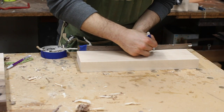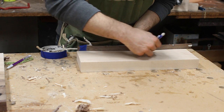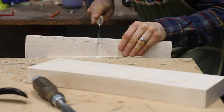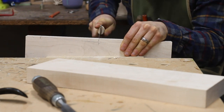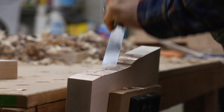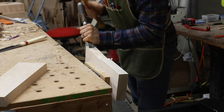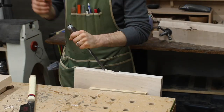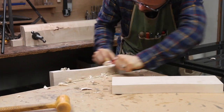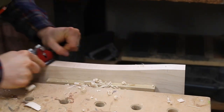Before attaching the legs to the workbench, I decided to give the bottoms of the legs some shaping. I think this looks way nicer than a blocky leg, but it's actually functional too — I don't want the center sections of the legs to ever touch the surface before the inner jaw or the far end of the legs, because if this happens, the entire workbench will rock. So I marked a shallow curve and started cutting out the waist, first establishing a center line with a handsaw, then chopping out the bulk with a chisel. The waist pops out pretty easily but leaves a really rough surface.